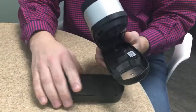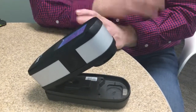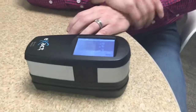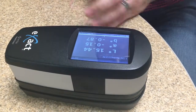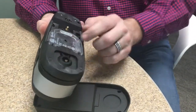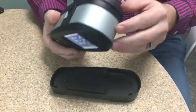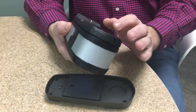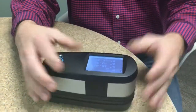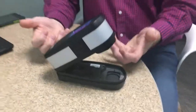If you leave it in the open position, will it automatically calibrate? Yes — as long as the instrument wakes up in that 24-hour period, it will say it needs to calibrate and then go through the calibration procedure. Now, if you leave the instrument in a lockdown position — which some customers do — you can see that the calibration plaque is not covering the optic. So in a dirty environment, dust can potentially get inside the optic, which is not ideal. And if it needs to be calibrated, the cal plaque isn't there, so it won't go through calibration. We recommend leaving it in the up position so it stays charged and can calibrate when needed.